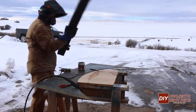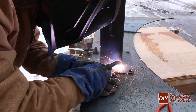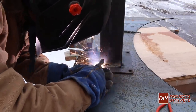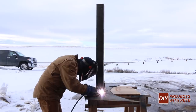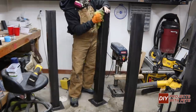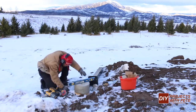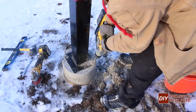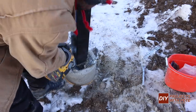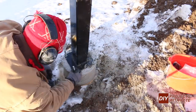The ice still needed some time before it was ready to be skated on, so I started working on the light posts. I cut four inch square tubing to four foot lengths and then welded it to a pre-cut and drilled steel plate I found at our local steel yard named Pacific Steel. After welding everything up I cleaned up the steel and then sprayed them with black spray paint. I attached each metal base to the concrete using half inch concrete anchors. The bolts ended up being pretty close to the edges of the concrete so I angled them in a bit and then drilled a couple more holes through the metal closer into the square tubing and used some additional concrete bolts.